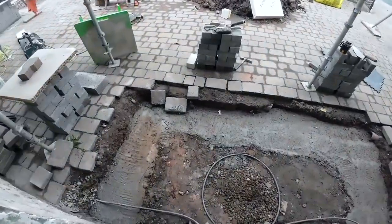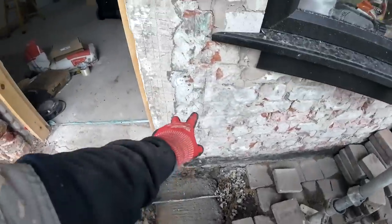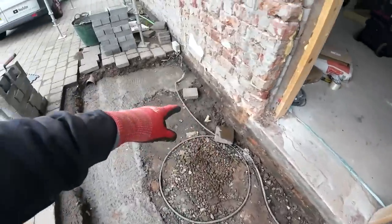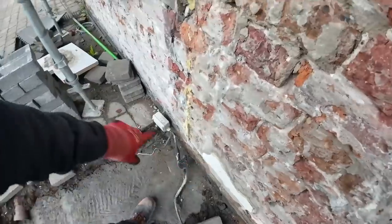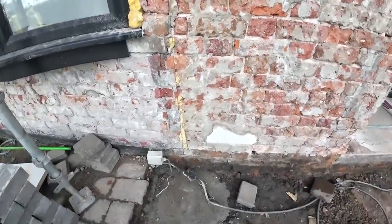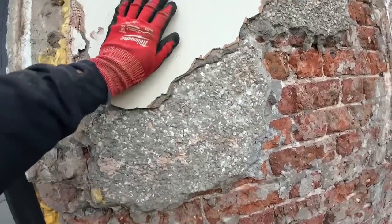There's not a lot in this thing, about 60 brick, four courses to damp. There's our building line. Just going to build over that wire, twist it back, take that junction box outside, build that in under there. And then there's going to be a starter pack going up here. Not sure if you want this taking off or not, we'll have to see.